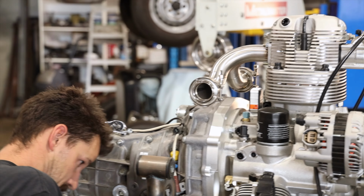I'm thinking out loud here. I almost want the exhaust to not be mounted to the body, but maybe mounted to something of the motor. Maybe I can make a little bracket so that everything will move in sync. Our cradle will be rubber mounted, so it obviously has movement for the torque. But if everything could go as one, maybe this would be all right. I'm just going to tack a couple more bits here, then I'll pull these off, and then we'll give everything a little cleanup, stand back and have a look.